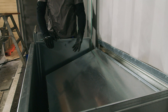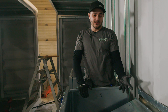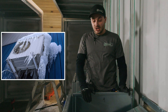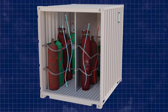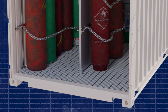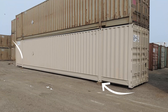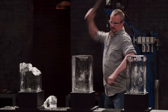One thing here is we didn't remove the wood floor underneath on the outside. But if this was going to be heating instead of cooling, the condensation is going to happen on the exterior condenser. In that instance, we hypothesize that if we remove the wood flooring and put an inch and an eighth bar grating there in its place, then all the condensate would drip down and through and underneath the container. If you're doing that, you'd probably want to block up your container and have a lot of room under there, especially as the icicle builds up, so you can chip that away.